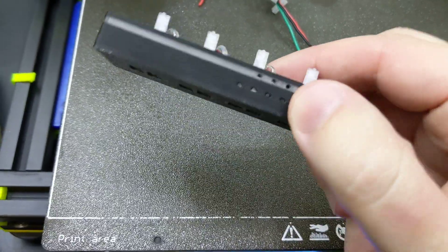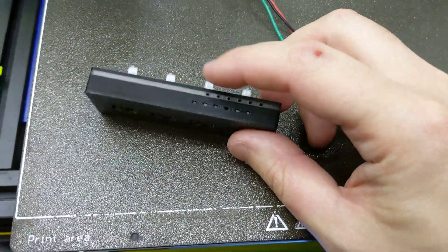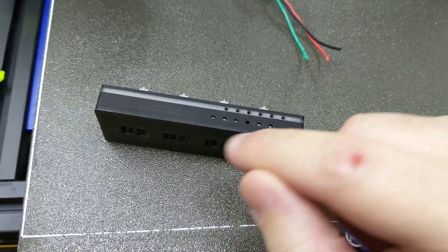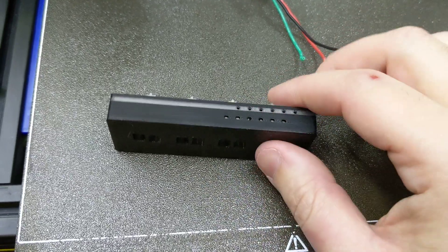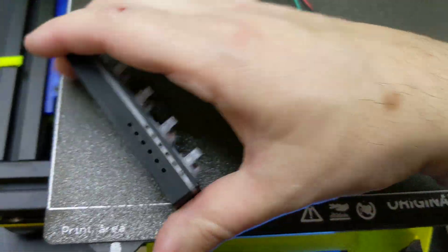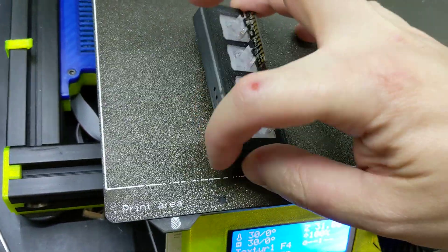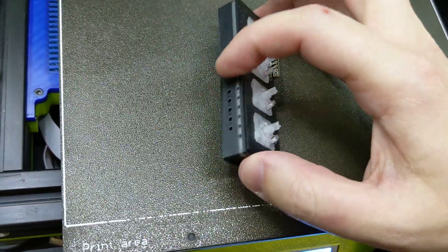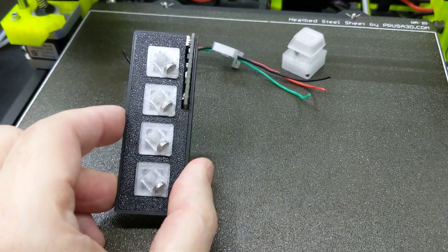This should be bright as hell. Here's another cool feature: I love making capacitive touch stuff. I'm going to run a wire from here to here to here — six wires total — at an angle, because that's what they recommend for doing a touch-based slider. If I drag down with my finger, it'll scroll down the screen. It's basically going to be a scroll wheel kind of feature. This will sit on the left hand right next to my keyboard.